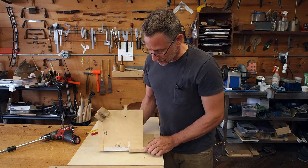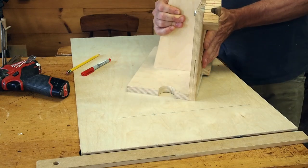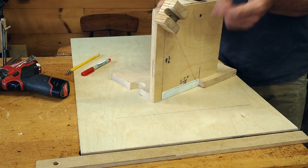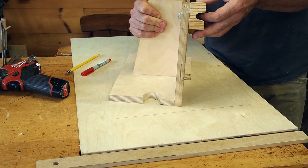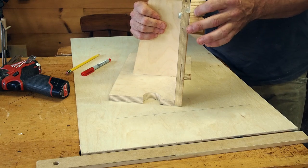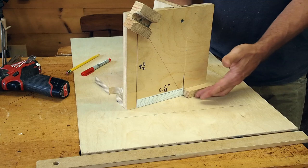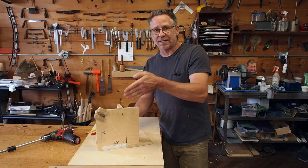That explains the angle along the sight line, but we also need to ensure the drill bit stays dead plumb — parallel to the face of the jig. That's done by relating these two pieces of wood. The swivel block has a little bit where it keeps the shank of your drill bit off the surface. You need to know that distance — here it's half an inch. Then add half the thickness of the shaft, so a quarter inch plus the half inch means this block has to sit three quarters of an inch off the surface. That keeps the center of your drill bit dead plumb throughout the whole process.